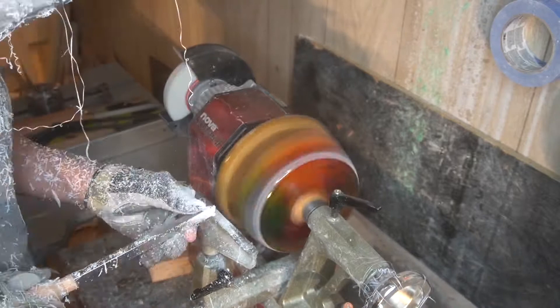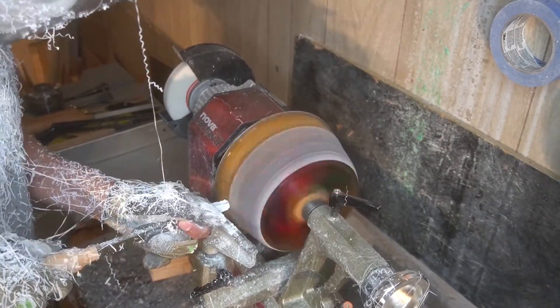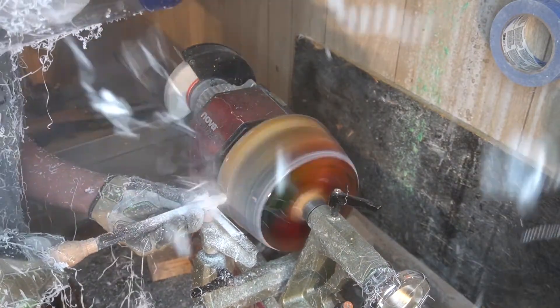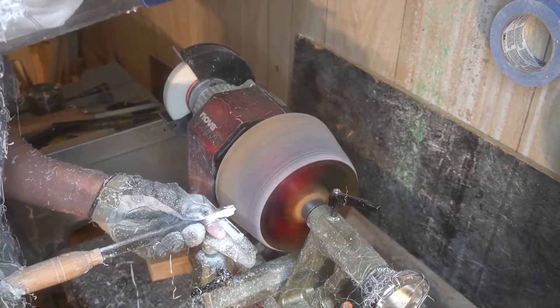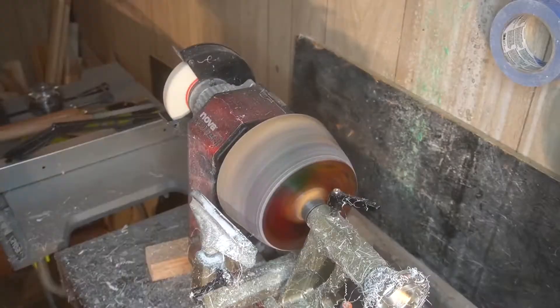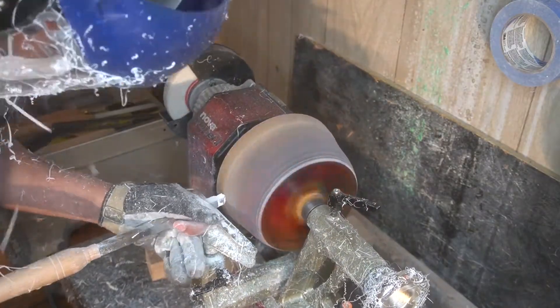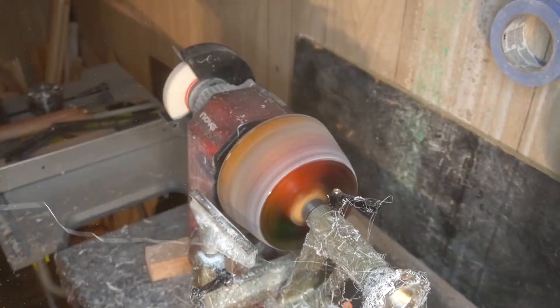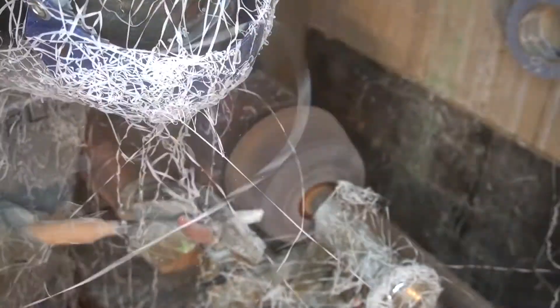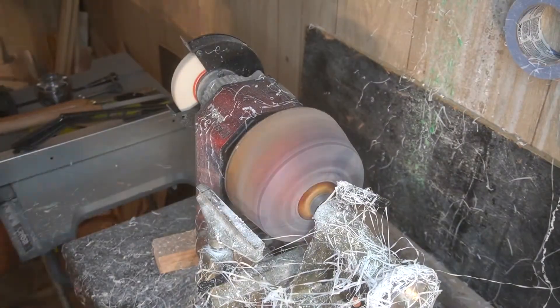I was going to use the round carbide tool, and I was going to use the bowl gouge to get off that superficial layer. Initially I was getting a lot of shards of glass — I'm thinking maybe it's not so much my technique as much as it is that chisel hitting the epoxy. So immediately I switched over to the round carbide tool, which was a really smart move on my part, and I rarely make smart moves. I was getting a lot of better ribbons off and was just able to get that nice round blank like we typically like to do.